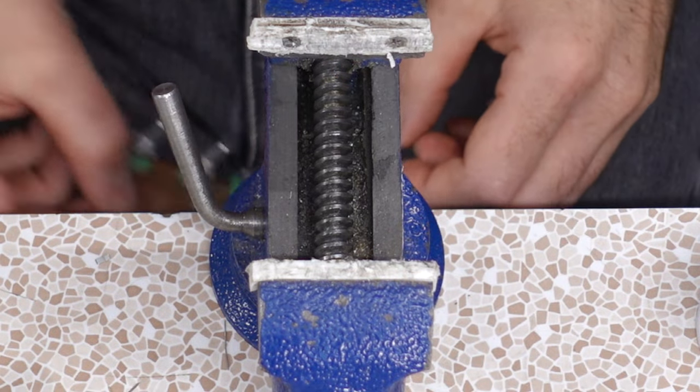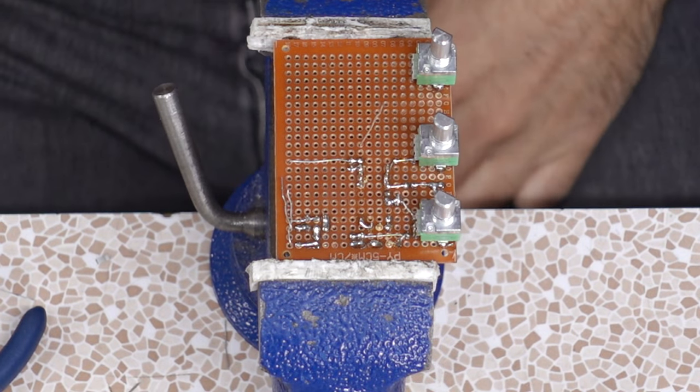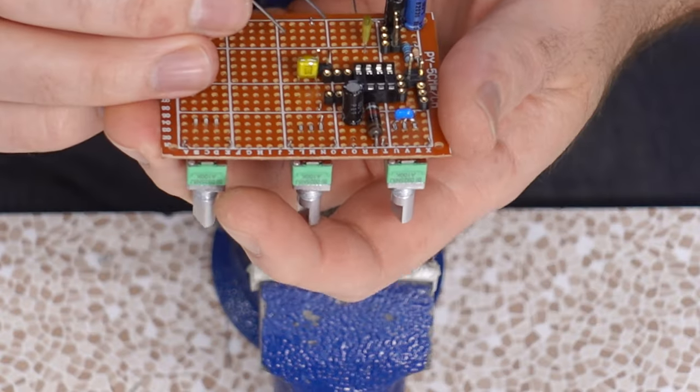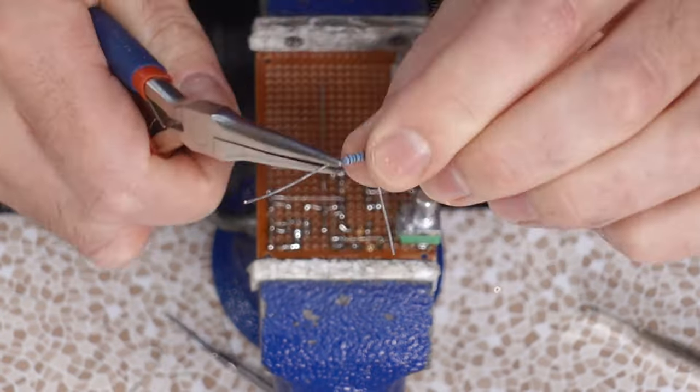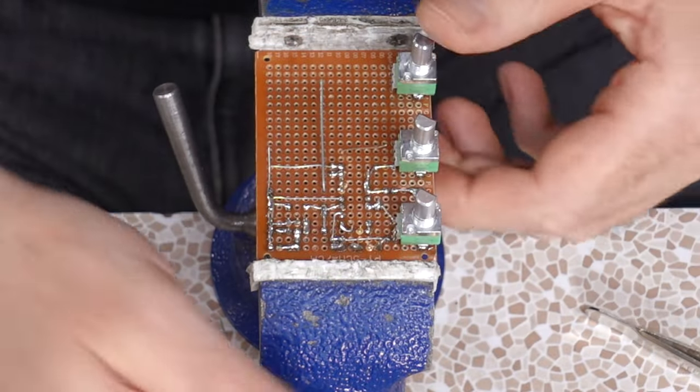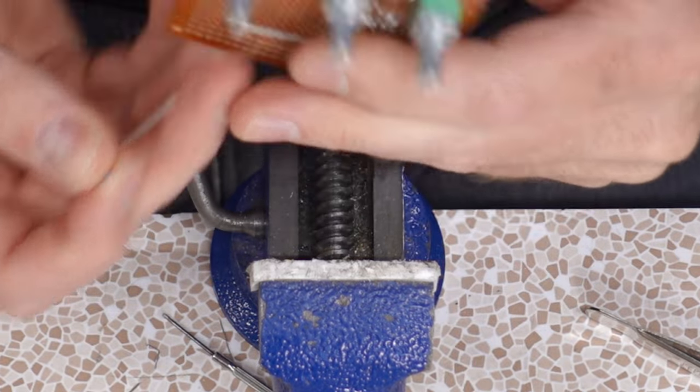Come on, man. I need to take a break. Really, not sure what to expect of these old carbon comps. Normally, I wouldn't much care for a carbon comp. Unfortunately, though the schematic calls for a 1.6K, I have a 1.5K in stock, so that's gonna have to do.